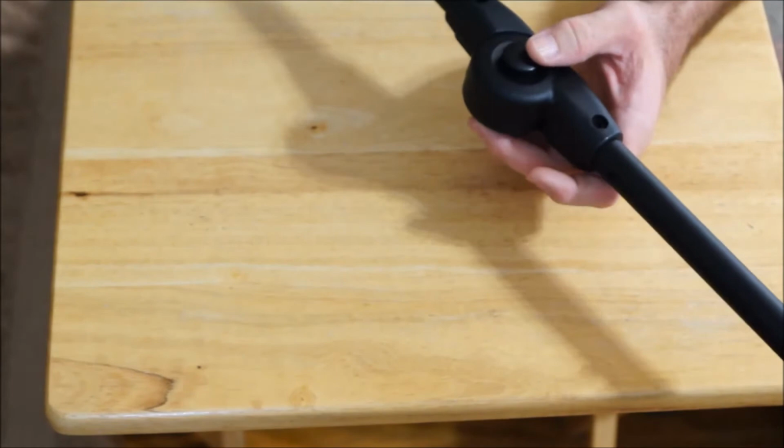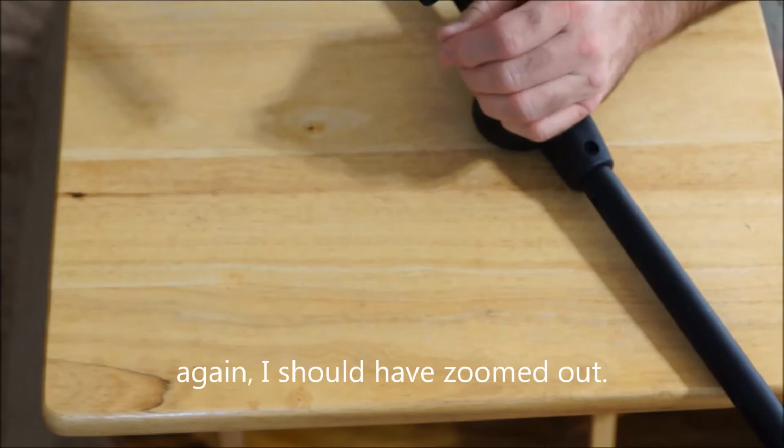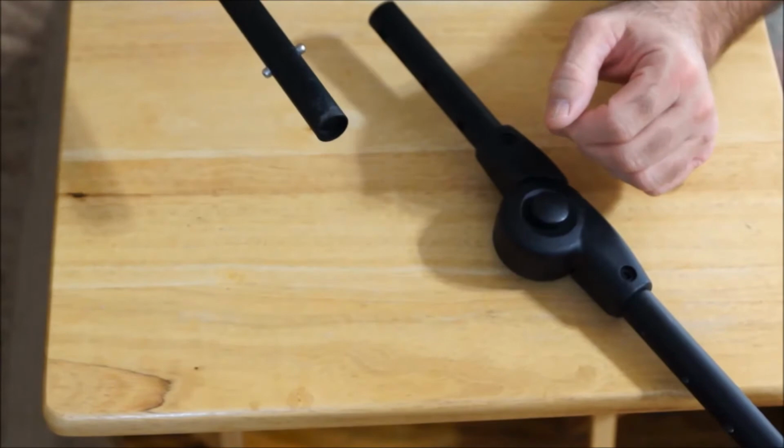But to test it out, to know you're going to have it in the right spot, get your S-bend unit with a control box and everything attached, and your shorter tube, when it's attached here and locked in with your spring clip, that's going to be your reference on where everything's going from there. I'm leaving the cam locks off for now. This is just making it a little easier so the cam locks aren't in the way when you're doing your alignments and all that, but that won't be an issue in final assembly. So just put it back together.